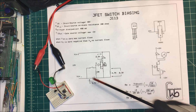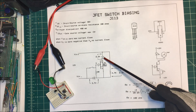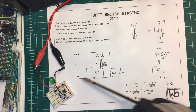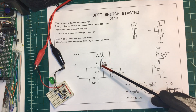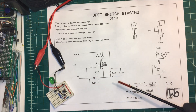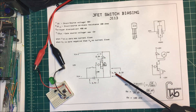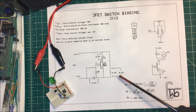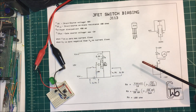We're going to use it as a switch, so we're going to put 12 volts in and come through our LED here, then through the JFET and back down to the negative rail. We're going to drop 2.2 volts across the LED, 5.9 volts across the FET, and another 3.7 volts across the Zener diode here — that adds up to our 12 volts. In this loop we've got our 4.7K resistor, and that's going to drop 8.3 volts, which plus the 3.7 volts adds up to our 12 volts.